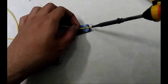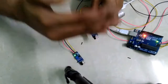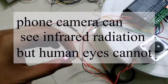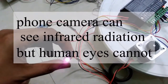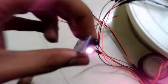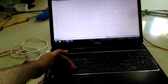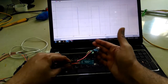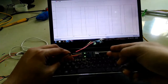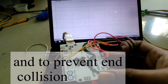We are using an infrared receiver module, also called an infrared proximity sensor. It consists of an infrared emitter LED and an infrared receiver. When an object is nearer to the proximity sensor, the infrared receiver will receive more intense infrared light as it reflects back from the surface. So if the carriage comes very near to the edge of the platform, the infrared receiver will tell the microcontroller that the carriage is near the end, and the motor direction will change from clockwise to anticlockwise. This is a way to keep the carriage from falling out of the track.